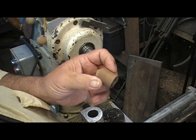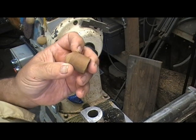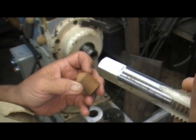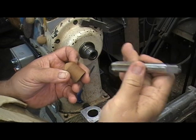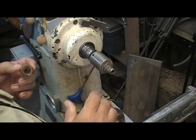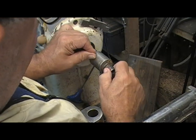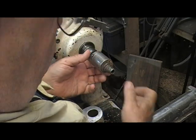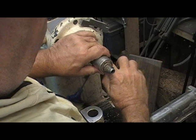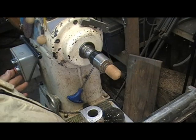Now we put a soft touch. A soft touch is just a piece of cherry that's been drilled with a 5/8 inch hole — 11/16ths is preferred — and then tapped with a 3/4-10 high speed steel tap. This comes from the Ace Hardware store. We tap this out, so now we have a soft touch — that's what I call it. We put the revolving center in our headstock, put a 6-penny nail in the hole, then use common electrical tape. That's going to keep the nail from spinning out. Don't use the knockout rod to do this. This piece is fixed and it will spin with the lathe to be machined.